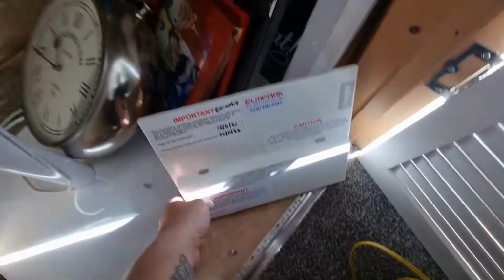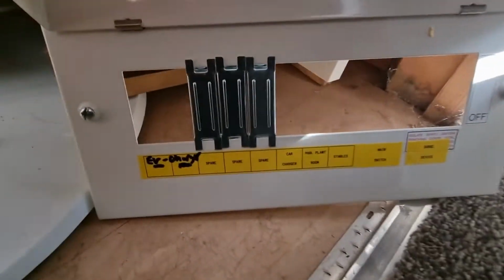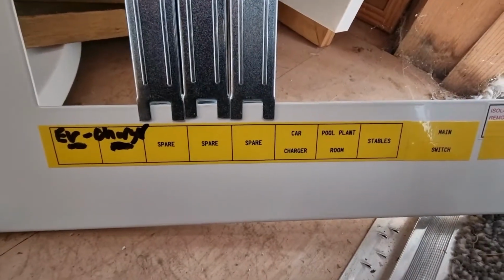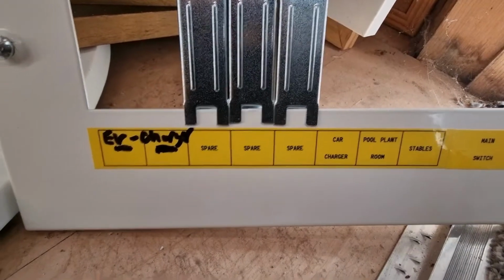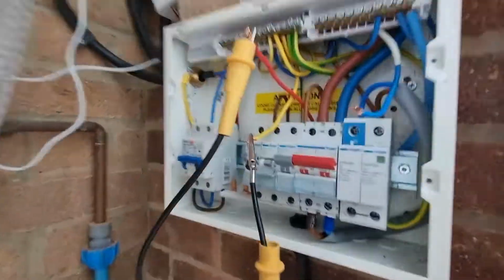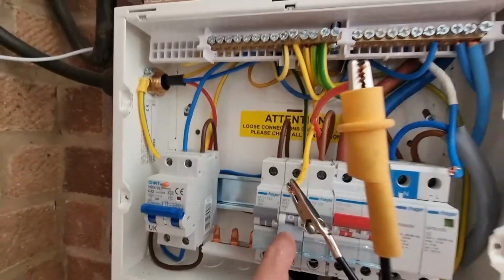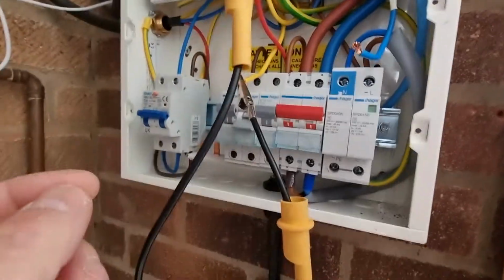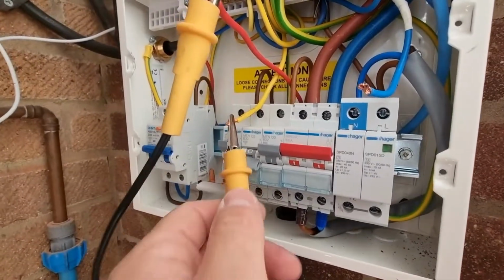Anyway, so this board down here, that's the cover. So if we have a look in there, you can see that you've got the stable supply, the pool plant room, and then the car charger. So the second one along should have been the pool room. I've taken, as you can see, that's switched off. Number two, I've taken all of the ends out, and I've put a link between the live and the earth,